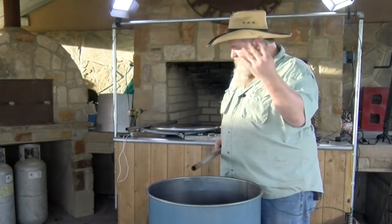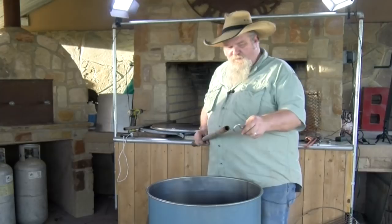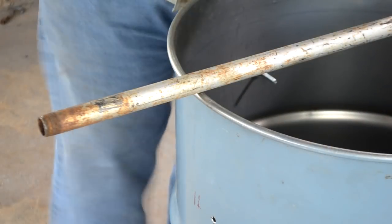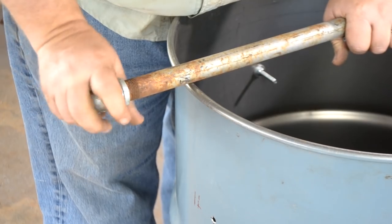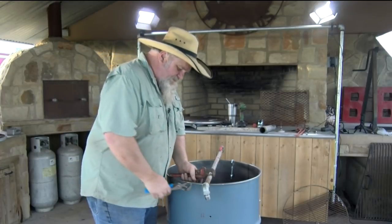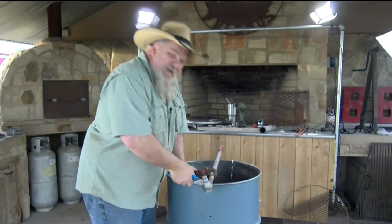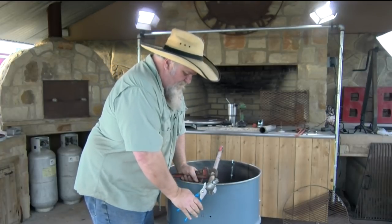Pipes off. Take my eye bolt off. My other eye bolt that we've enlarged some — I can put it on here. And it'll slide on but it won't come off. So we'll screw a 90 onto here. It's going to go into our hole. Now I've got my 90. I already put my nipple on it. I'm going to take it, screw it on. So I'm just going to throw my pipe wrench on there. I just want to get it good and snug. I kind of cleaned out that pipe. We just ran some water through it to blow it out. Anything — any bugs or rust or whatever — we banged on it a little bit and cleaned it out.